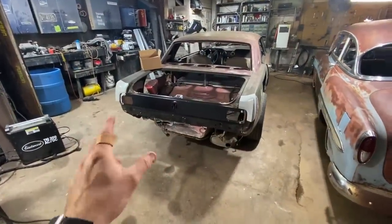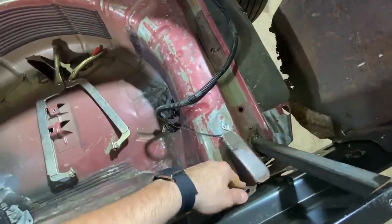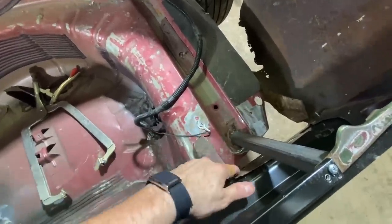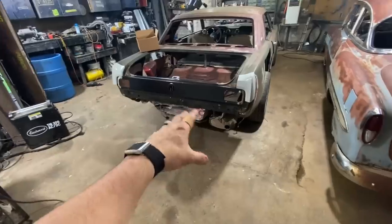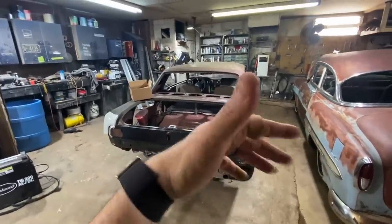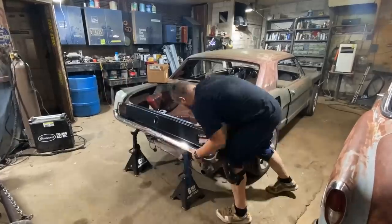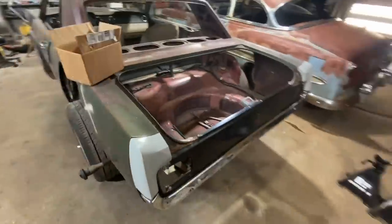The reason I want to get the bumper installed is because the frame actually bolts to the bumper — it bolts there and then this would be welded to the '65 frame. I want to weld that now to my modern frame, so I don't know where to put these unless I have it exact. I'm going to get these bolted in so I know where everything's going to be, and then we'll get a good weld on both sides. Anybody that's ever installed new parts knows there can be variants in the bodies — after 70 years there's definitely some variance in there.